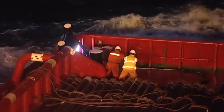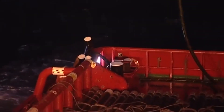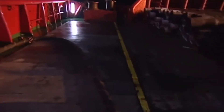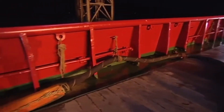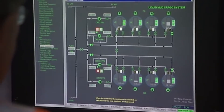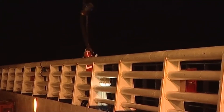The air pressure must be vented from the hose. Deck crews should check that the hose is less rigid before they disconnect it. It's possible that the installation will need to backload bulk liquids, often contaminated drilling muds. The vessel must be certain what hazardous chemicals are contained in these muds. There must be a proper plan, with agreement on pressures and emergency stopping procedures.